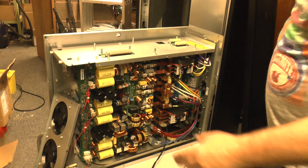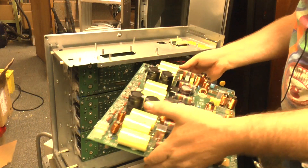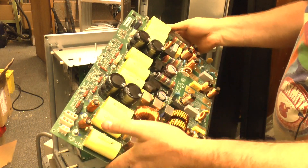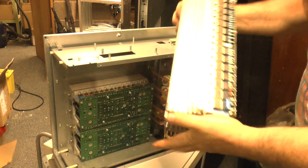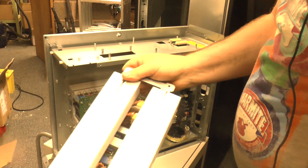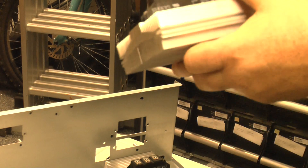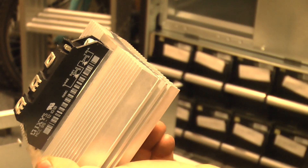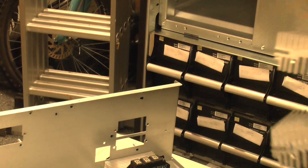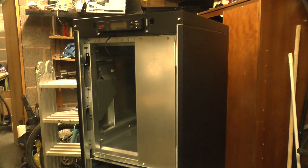Also, if you wanted to change the fans without cutting the cables, this is as far as you've got to go to do it. There we go — quite a heavy board, this one. That's the power interface board. One 6.67kVA power interface board — I think it's basically a 400 volt power amp. And unlike the 40kVA one, no scorch marks on these. Some nice contactors. Apart from a nice bit of copper, and some nice chunky double thyristors — three of those in the static bypass module at the bottom. And that's that. That's the power module done.